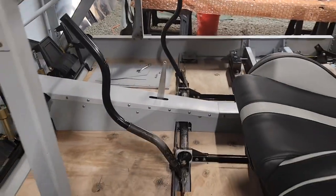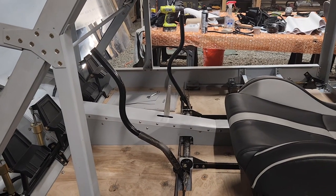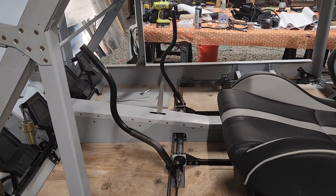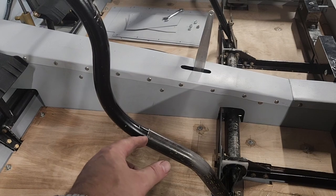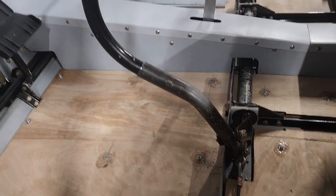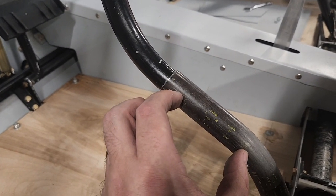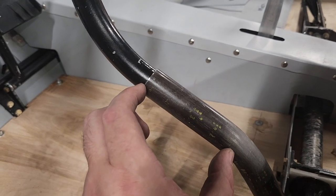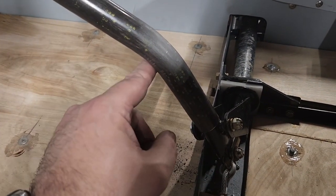So this one ended up actually being 30 degrees. I cut a 20 degree and a 30 degree and tested both, and I'm not completely sold on the 30 degree because it is a little far forward. I forget the inside diameter of this. It's really, really tight. There's no play in there. Obviously I still need to bolt it, but these are 3.5. I also need to play with possibly making this shorter in order to get more of this down in there. Because of the curve, I don't know if it's even possible. The 3.5 is about the maximum you can get without hitting this curve, and both of them are identical. They're both 3.5 from the vertex there.